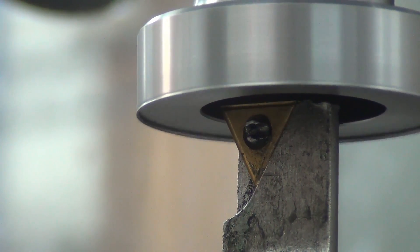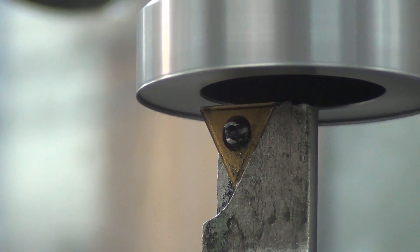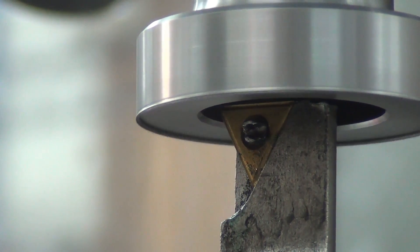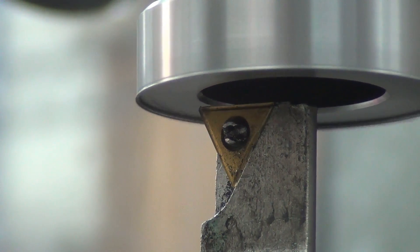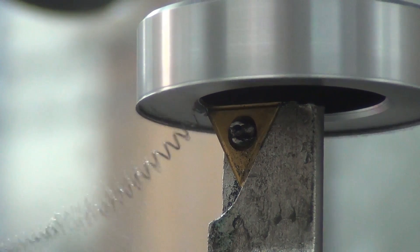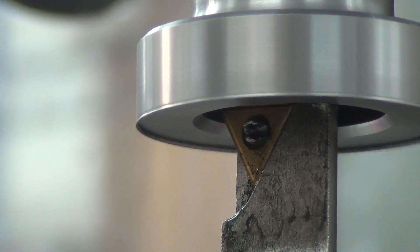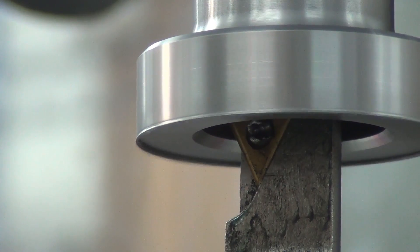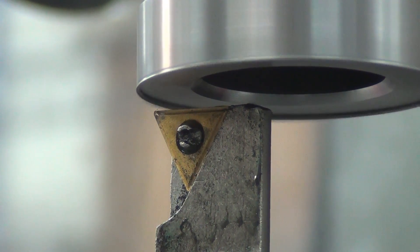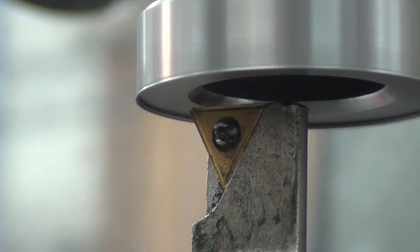Most of this airspace here is because it's set up right now to do two different bearing adapters - two different lengths of bearing adapters. By setting it with an 80 thou offset, I can do the bearing adapter I'm working on now, and that's why there's more or less 80 thou worth of air being cut. If I get rid of that 80 thou offset, it will cut the shorter one for the 620. You can see there - if I didn't do that chamfer, which it did on the first one I did, it will crash, because it'll take such a big bite out of that corner on the ID.